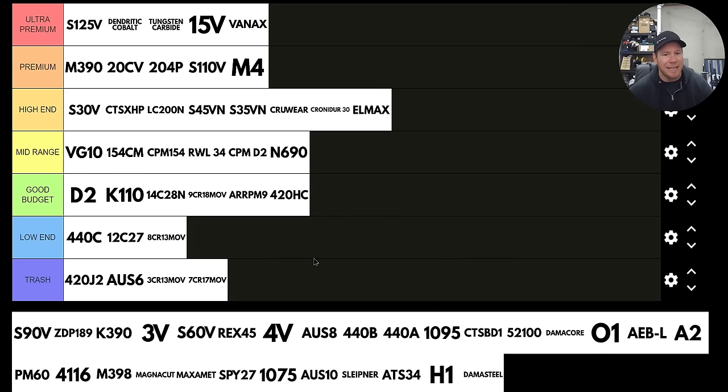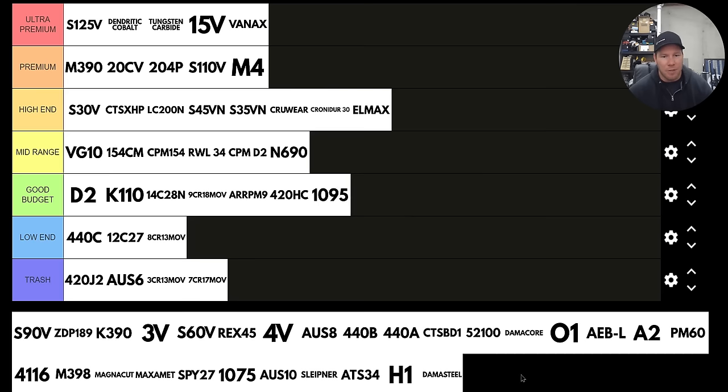420HC, I'm gonna put in good budget. Buck is a great example of a company that does apparently a very good heat treat on 420HC, and a lot of people like it. It's been around for a long time. 1095, I'm also gonna put that in good budget. You see that more often on fixed blades, and I think it's a much more appropriate steel for a fixed blade. Not gonna hold an edge very well. Crazy tough, really great for fixed blades and stuff like that.